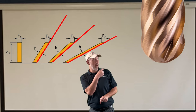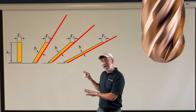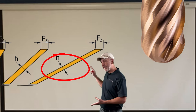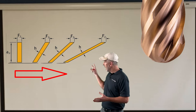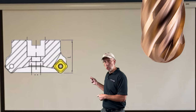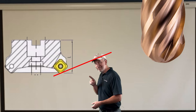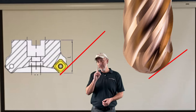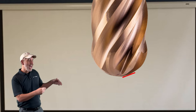Pay attention to the diagram showing how that lays out. Now put your attention over on the ball nose. You see something on the end of a ball nose that looks really similar to a lead angle on a face mill? Yes, we have a radius on the bottom of it. Look at how that starts to lay down the closer we get to the bottom. When we talk about surfacing, our axial depths are very light — we're not using the side of that ball nose, we are using the bottom.